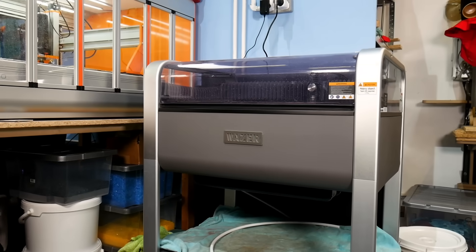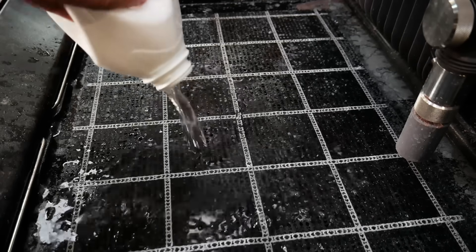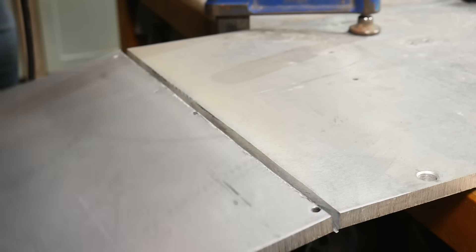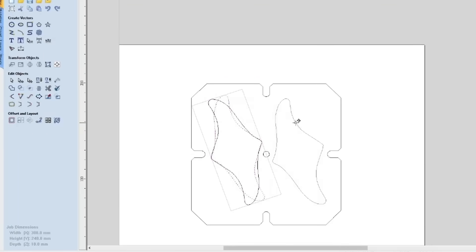In order to cope with the much higher pressures involved you'll need to upgrade from wooden molds to metal ones. While you can buy these molds pre-made, we've got a brand new machine in the workshop that means we can make them ourselves — I'm very proud to introduce our Wazer waterjet cutter. This very cool machine mixes a high pressure jet of water with an abrasive which means it can cut up to 12mm thick aluminium or 6mm in steel — a bit like a laser cutter but with water. It can also cut HDPE so we could use it to cut profiles like we did with the CNC. We had a little scout around and found some 10mm aluminium plate, cut it free with an angle grinder and mounted it on the Wazer. We used our Vectric Aspire CAD software to draw the shape of the mold plate and then transferred this over to the Wazer CAM package.